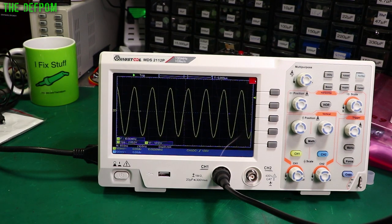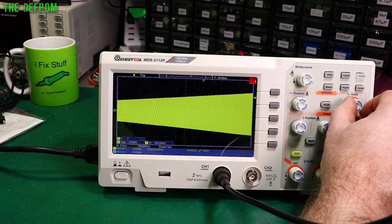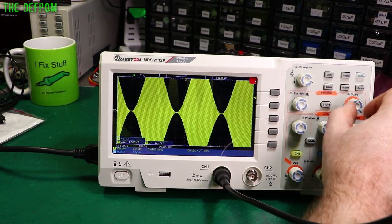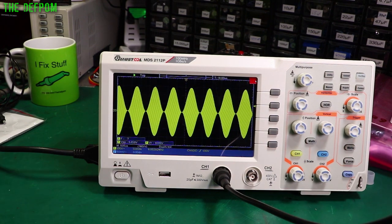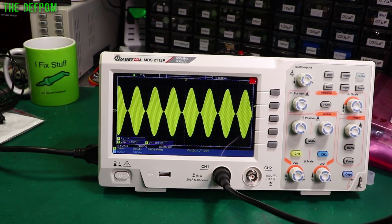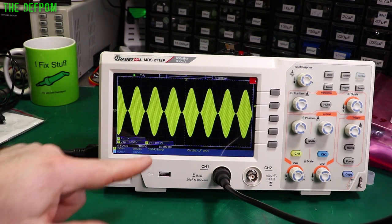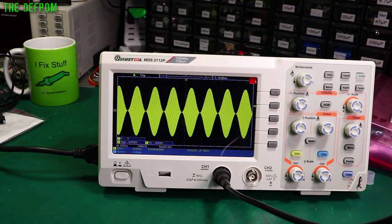You can actually see it on this — if I turn the modulation back on again, you can see it's 10MHz here. If I bring it back down, there is our modulation, right there. So it can even do that — that is brilliant. Not every scope can do this, it's quite a big test for it, and this is actually doing it fairly easily. Once I've figured out the settings to get it to work on this particular scope, it's doing it easily. Because of that, I'd like to get this frequency working accurately so I can use this as a reference scope in my RF lab.